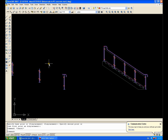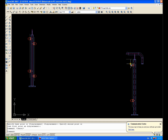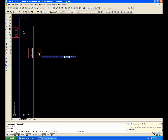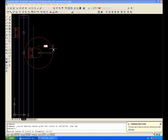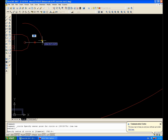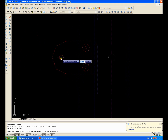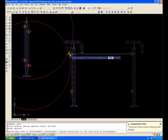Right, so here we go. The first dimension that I've taken on site is from that pin to that pin, and the second one from that pin to that pin, so I've got to draw a triangle using these two pins to a point over here. The first dimension is 795, so from the centre of there I draw a circle with a radius of 795. Then draw an intersecting circle from there with a radius of 740. These sizes are off my site survey.